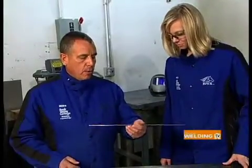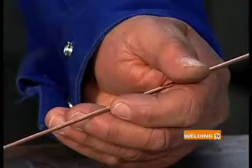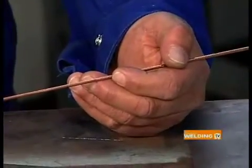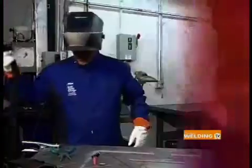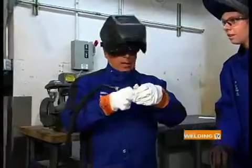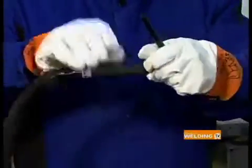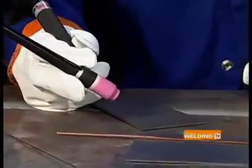You need to learn to walk the rod through your fingers. As you're welding and adding the filler rod to the bead, the rod keeps getting shorter. You can move your hand closer and closer, or learn to feed it through your fingers. I prefer holding the torch similar to a pencil — some people start out holding it differently, but you have much better control holding it like a pencil. I also rest my hand down on the workbench, and my filler material is fed with my other hand, also rested down. It helps keep it steady.